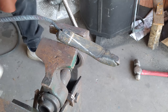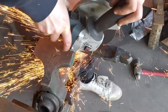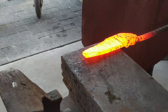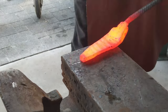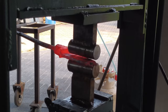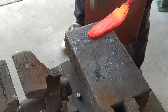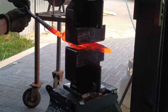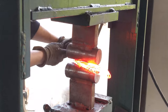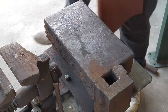I'm cutting off the steel I don't want on my knife while the blade is not yet defined. The blade is still about half an inch thick, and this gives me a big margin so I can forge the blade how I want. Because not everything can be made with the press, I take a hammer and forge the tip of the blade by hand. Here is the moment I press the steel and make the heel of the knife — this is exactly the reason why you need to define the ricasso a little further than you think it should be.